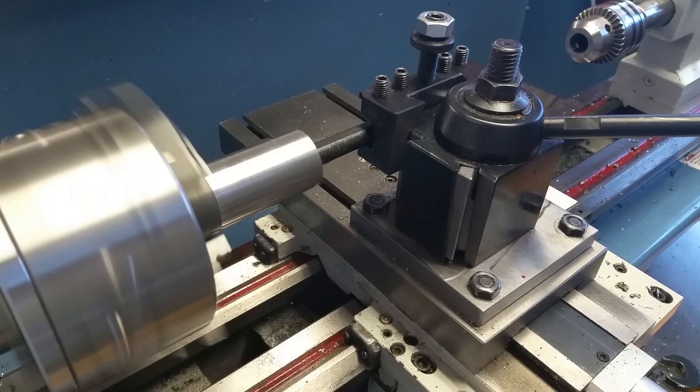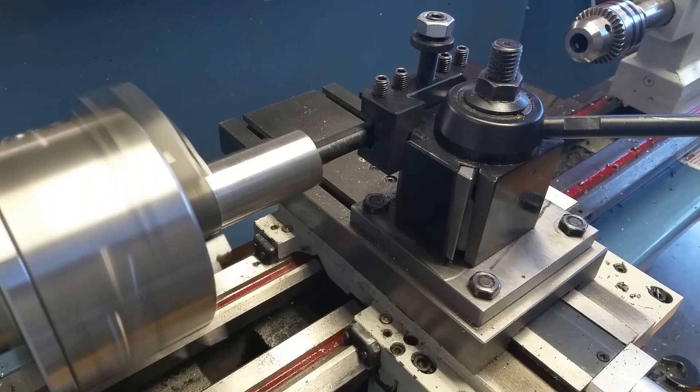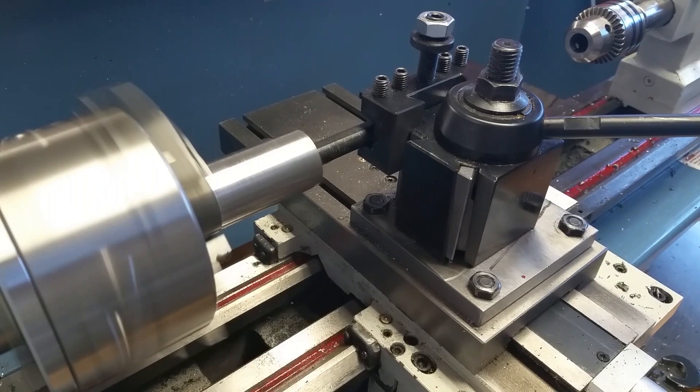Let's stop right here — this is an editor's note added after the video is completed. I'm going to let you in on the biggest secret of this whole video: the secret to making bores that have a consistent diameter all the way through. Assuming you've done all the obvious things — oil your ways, tighten the gibs, make as many spring passes as you have patience for, and use the biggest boring bar that fits in your tool holder — the secret is: eliminate the compound. On a small lathe like mine, it's almost impossible to get all of the play out of the compound, so we just eliminate it and replace it with a steel plate like I've done here.